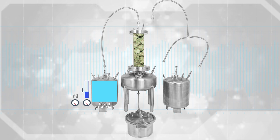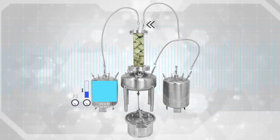Step 2: Attach your recovery lines. Connect one of the three ends on the recovery line to the top of the column vapor outlet on the side and the top of the extractor tank vapor outlet as indicated. Connect the third end of the recovery line to the recovery tank vapor inlet valve.